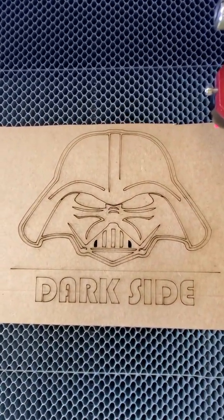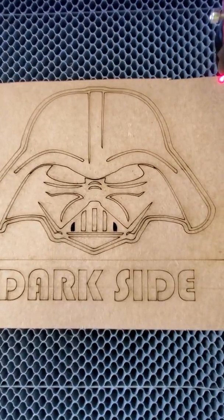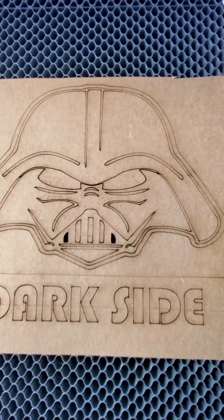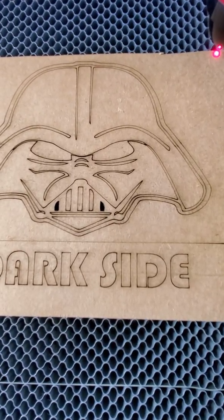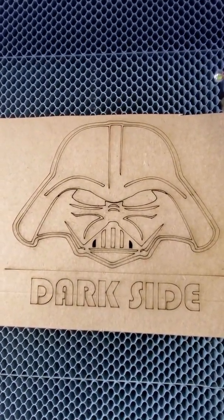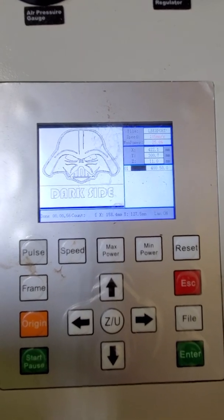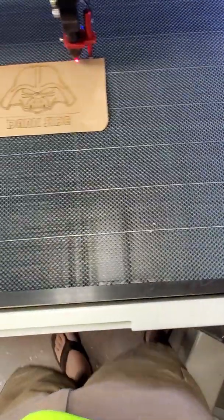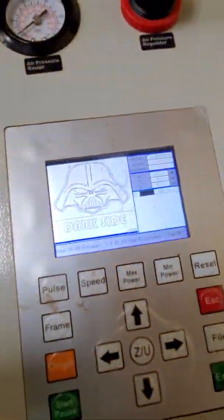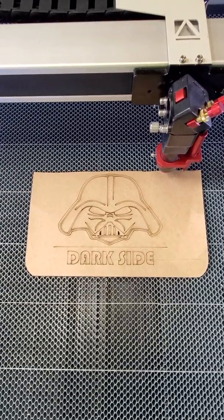Alright, back over here at the Nova 10 by Eon. Again, real nice clean lines. I don't see any obvious wavering — there might be just a hint of it around some of the tighter turns, but no different than I could see on the Thunder. This one cut at 56 seconds, which is a little bit slower than the Thunder. But you've got to understand also that the machine size is nearly twice the size, so that would account for that. Being only two seconds different for the size of the machine it is, I'd say I'm impressed. Let's go over to the Boss and we'll see what it did.